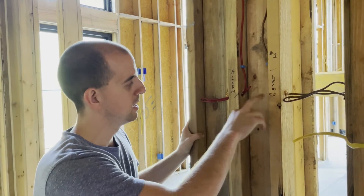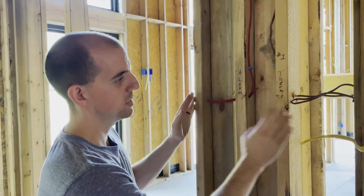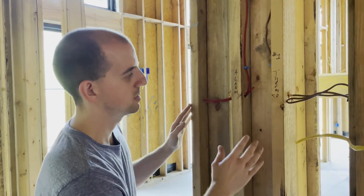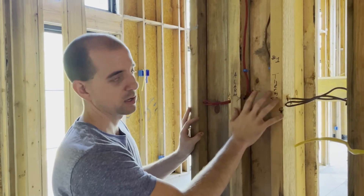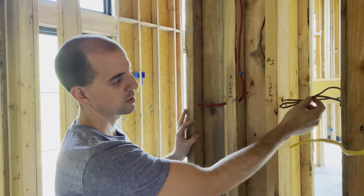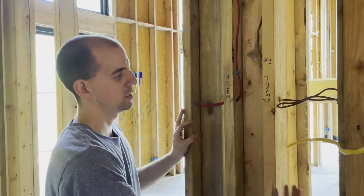This is at five feet height, same with the alarm panel. Because we don't know about window casements and door casements, we don't know exactly on this wall where these two devices are going to go — we just know they're going to be in this general area. So we've left ourselves a few feet of slack; if we needed to drill the hole up here and fish the wire out, we could — same from below.